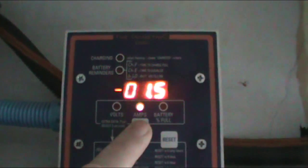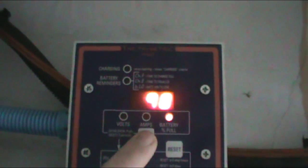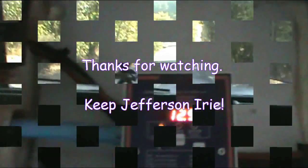I've got this switch here that just shuts the solar off if I want. That comes over here to the battery monitor — you can see I've used 2.73 amp hours since charging the battery. This is a Trimetric — you definitely want one of these. It shows me the voltage and the number of amps. With the lights on it's using one and a half amps, and the battery is at 98% full. Thanks for watching and we'll catch you next time.